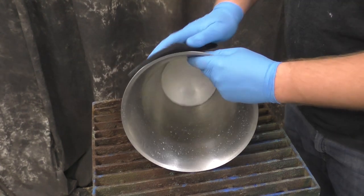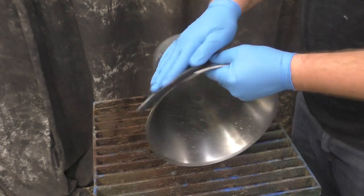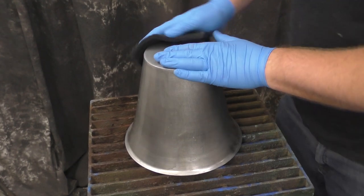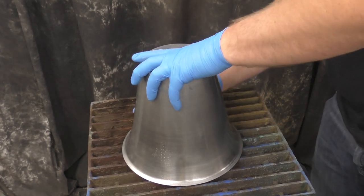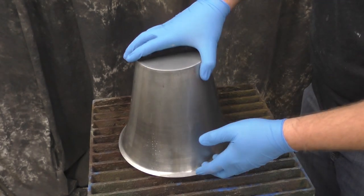We sanded this up a little bit here and there over the years and haven't really done anything to it, but we meant to, so it was sanded multiple times. Now we're going to use the Sculpt Nouveau metal cleaner and a Scotch Brite pad and just scrub it up really good. Remember when working with stainless steel to get a chemical patina, you do need to get through that first layer of nickel and chrome, so sanding is a good idea.